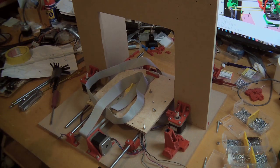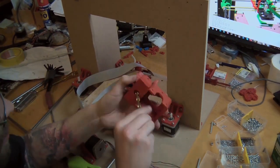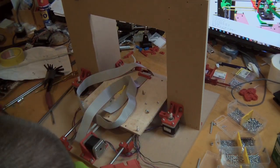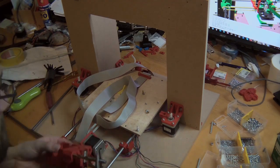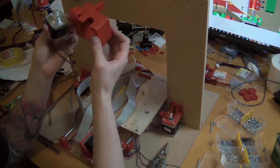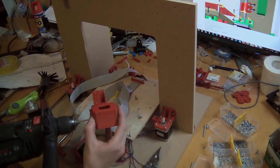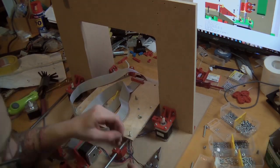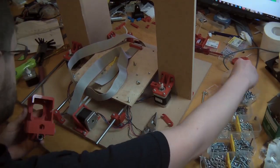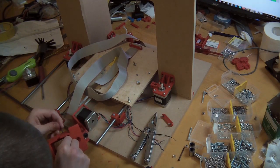Here is where I actually destroy my second linear bearing. The X motor bracket you see here is a horrible print — I had to print it 4 times before getting to this version, ran out of PLA, and the print stopped mid-print twice because the extruder stopped extruding. As it turns out, both linear bearings in the bracket are not perfectly aligned, so I had to re-heat and bend the material, which is why I destroyed my second linear bearing.